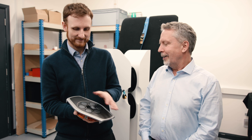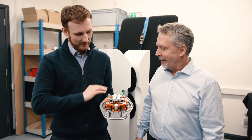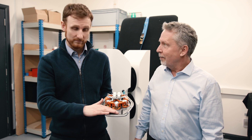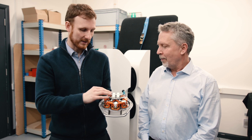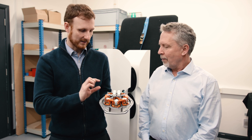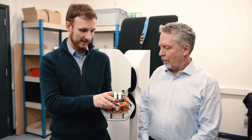Flip around the whole array to the backside — all the little drivers. It's really cool the way this fits together. Can you explain it? Yeah, so we have two surfaces: the front baffle, and we have a clamping plate on the rear here that holds all the mid-range drivers and the tweeter together, clamped between the two parts. So if I remove this spacing clamp plate here...